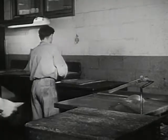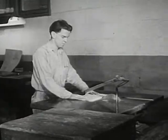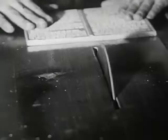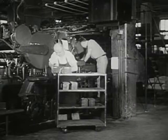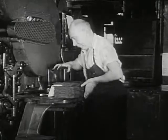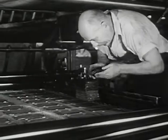Many books can be printed from copper plates. Now, the plates are cut apart. This sharp saw easily cuts through the hard copper. Each of these small plates has the words and pictures for just one page of the book. Next, the plates go over to the printing press. Here, this workman makes the plates ready for printing on this press. That is why they call him the ready man.